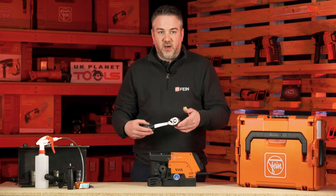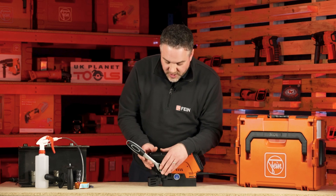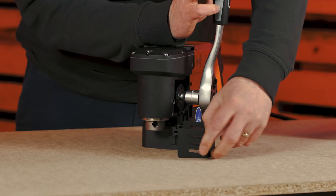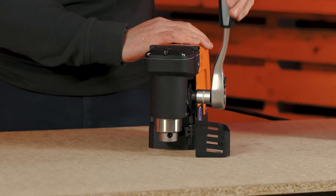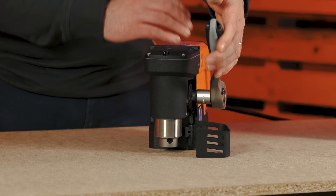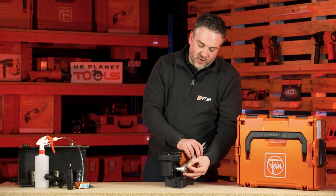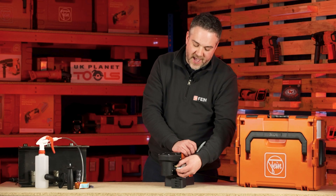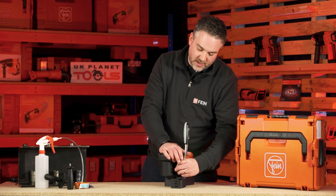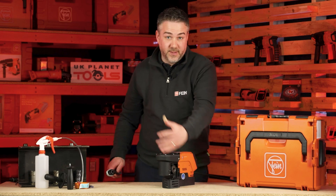The machine is operated with a half-inch ratchet that fits into the side of the machine. As you use the ratchet, the head comes out the end of the machine and will drill your holes, and you can also wind that back up as well. That's great for when you're in tight spaces where you can't have the usual three-angled arm because there's just not enough space within the I-beam to use that.